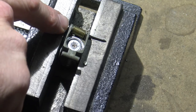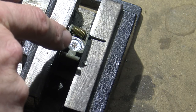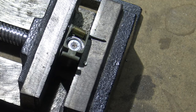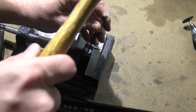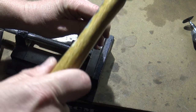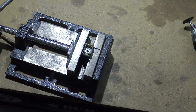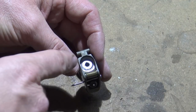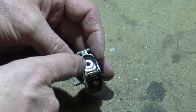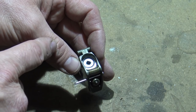After we've secured the firing pin, we're going to go ahead and tighten this down in a vise. Essentially what we're going to do is knock out the old primer with a punch. As you guys can see, we've knocked out the old primer. Unfortunately this hole is not big enough for those shotgun primers yet, so we're going to have to drill that out.